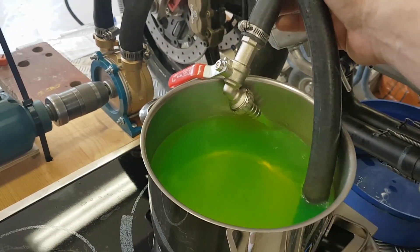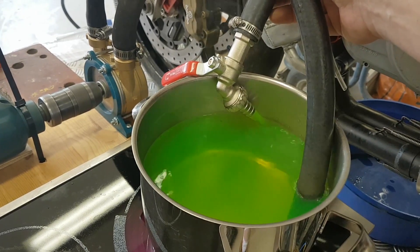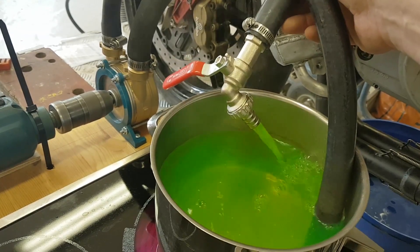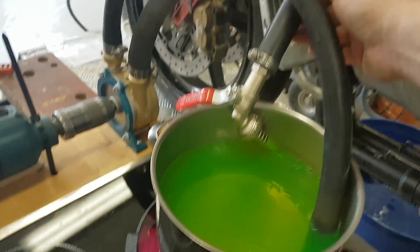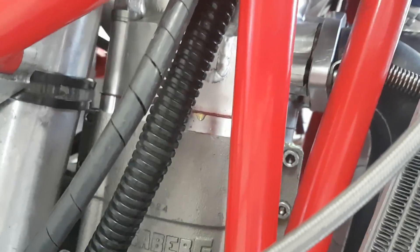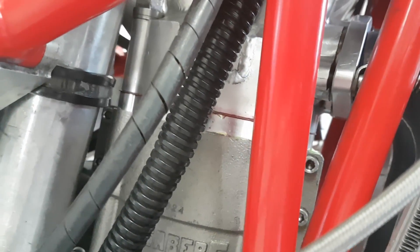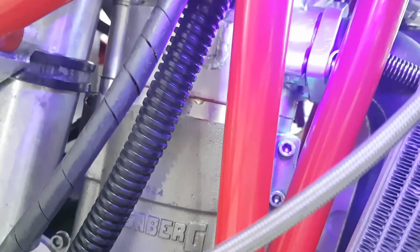As you can hear, I've revved up the drill to maximum flow and then choked the valve to get some pressure inside the system, making sure it really leaks now when I have the opportunity. There is a small leak here — you can see it with the naked eye, and even more so when adding ultraviolet light.